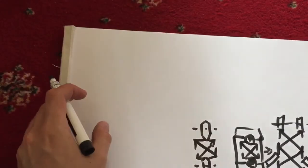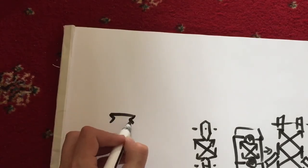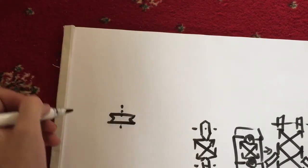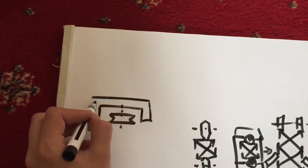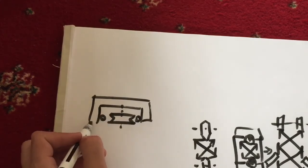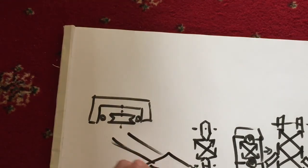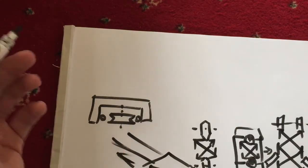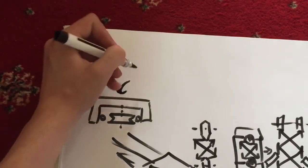Now I've also seen some linear rail systems that use basically a piece of extrusion like that that can be bolted down, and they use a carriage like so that has little ball bearings that clamp in there and they run along tracks. So here you've got the carriage and it just runs along the track using those ball bearings. Now that's a very, very nice solution. I think linear rail is what you want to be searching for to find that.